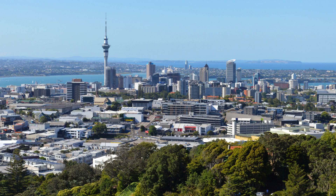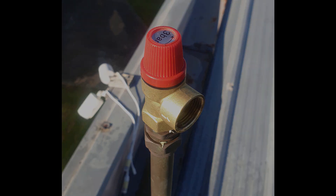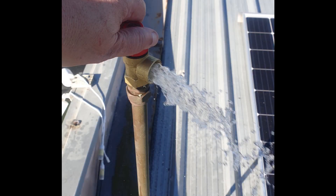If I lived in a city I could get around 24 liters per minute. If that was going directly to your kitchen sink and you put on the hot water, that's a lot of water. But normally in your shower the showerhead reduces that pressure and mixes it with the cold. Before I put the valve on my overflow pipe I was only getting two liters per minute, and when you mix that with the cold it was very little pressure — it took ages to get clean. When I put the valve on, it doubled the pressure, and when you mix that with cold it feels like two to three times as much. Now it actually feels like a real shower.